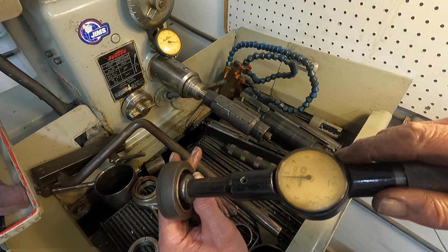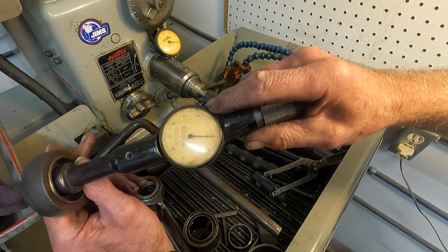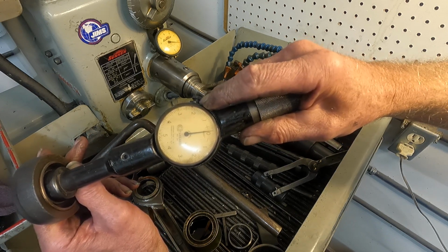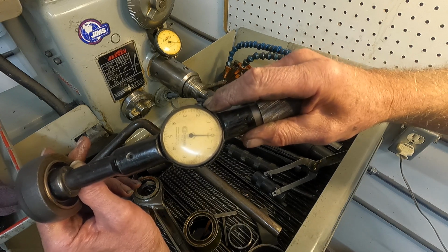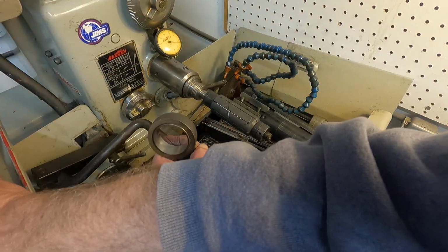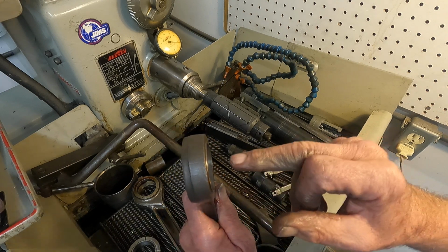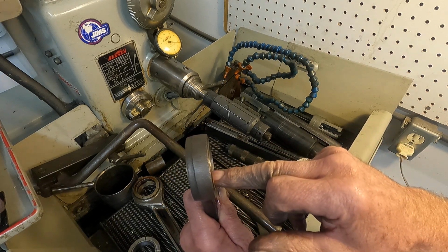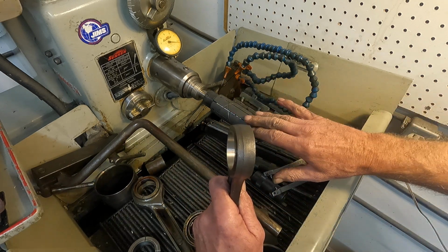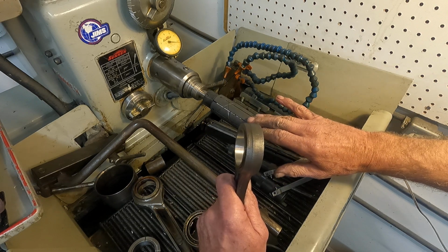In the last video, I started showing a change in finish. So, okay, I got this set on zero here, and let's check some stock removal rate here. I'm going to continue lapping this and show you the process. I got a wet lap, and that cuts faster. So we're going to continue a little bit wet lapping here.